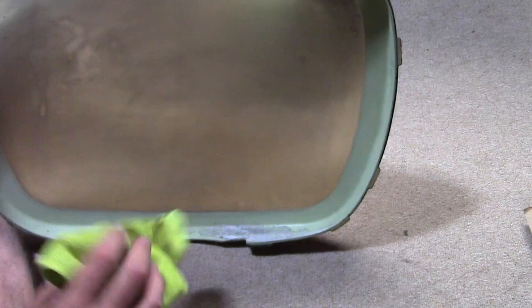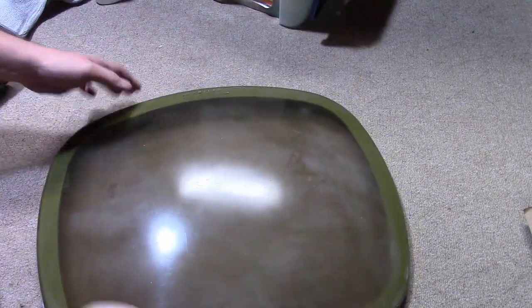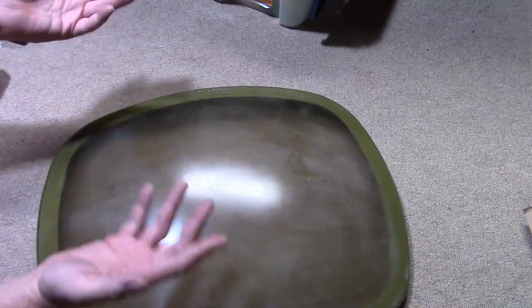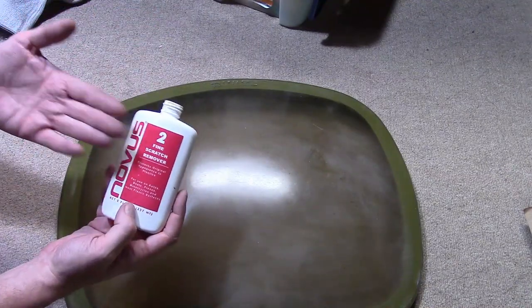This is especially bad down here — it makes me think some moisture might have gotten inside this cover. Obviously we can't see clearly through it yet, so I need to do a few more passes, but that's the basic idea. I'm not a fan of motorized buffing tools in general — I don't like using power tools around vintage stuff or antiques — but it absolutely does speed up the process, so use it at your discretion. As for the abrasive material, I find Novus No. 2 is my go-to whether it's Bakelite, plastic, tenite, or acrylic — this stuff works really well.